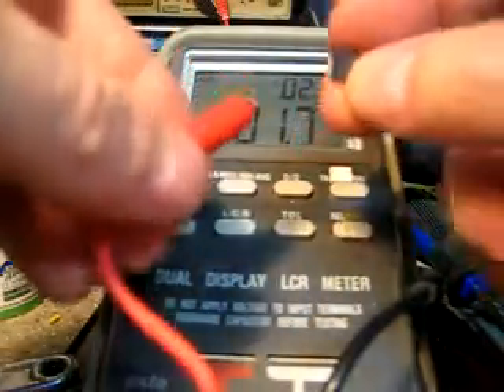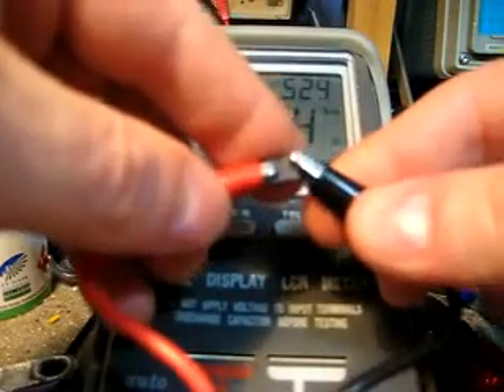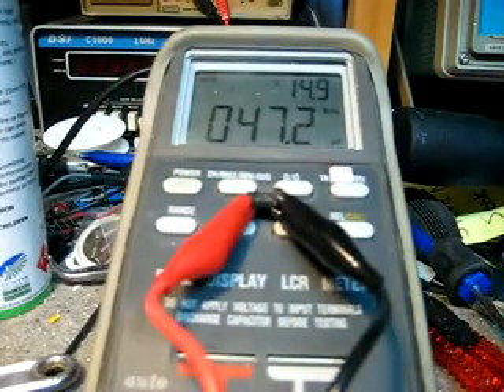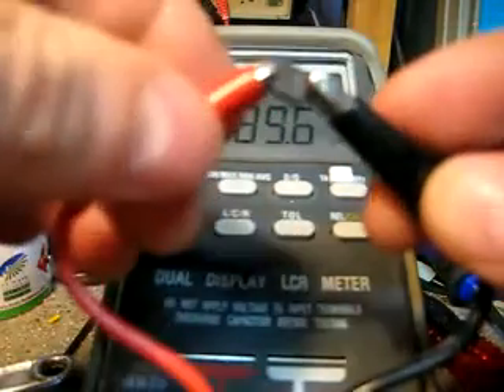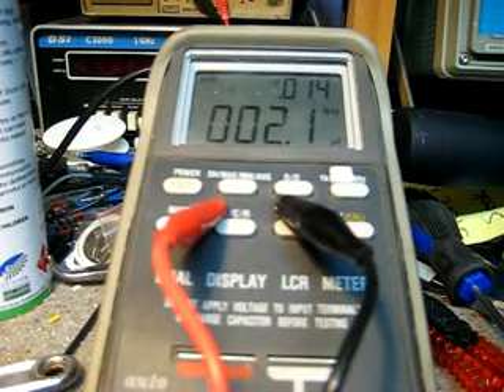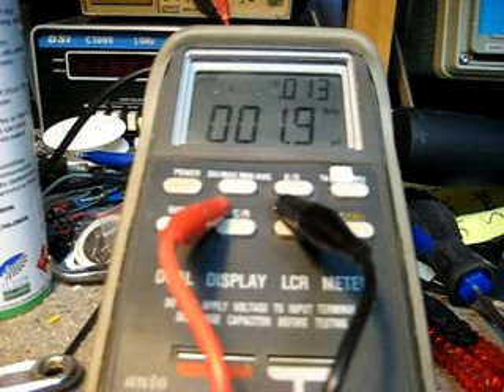Here's a diode I've had specially manufactured for myself to replace the old diodes in the detectors. This one will do more current too, and it has a lower voltage drop. Most importantly, this one's got 47 picofarads of capacitance, which is nearly three times lower than the standard ones. As you can see, I've very carefully ground the number off — keeping with the practice that Minelab do, because they grind the numbers off all theirs, I grind the numbers off all mine. So that's the new diode which can go in all the detectors and gives a good performance increase on small sensitive signals. It basically loads the receiver stage less — the less capacitance you've got there, the faster you can sample.